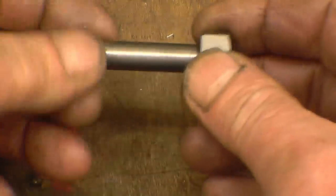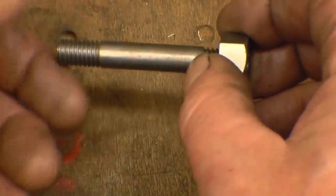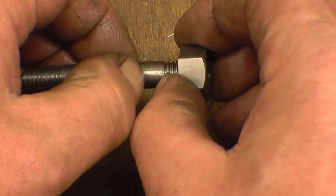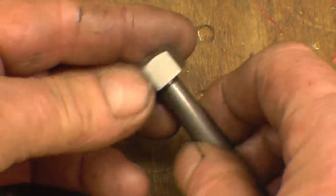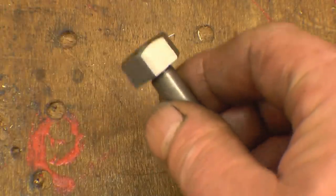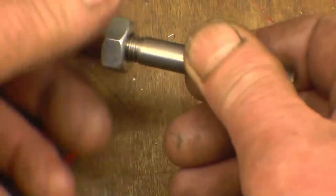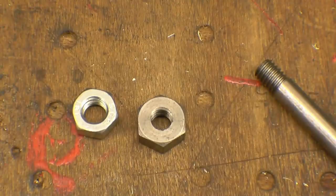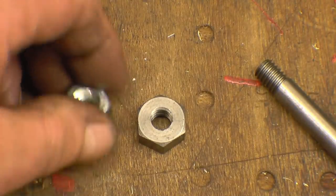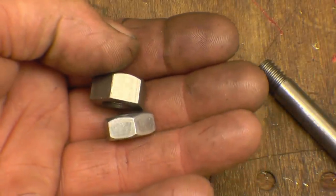The job I've got to do is simply to put some more thread on these studs. That's too long — I think it was 8mm from that face, and I want it threaded 3/8 Whitworth. Look at the 3/8 Whitworth nut compared to a modern nut — the equivalent is about 10mm. Of course it's a 10mm nut, but if you look at the nut there's something about the imperial nut — it's much more aesthetically pleasing.